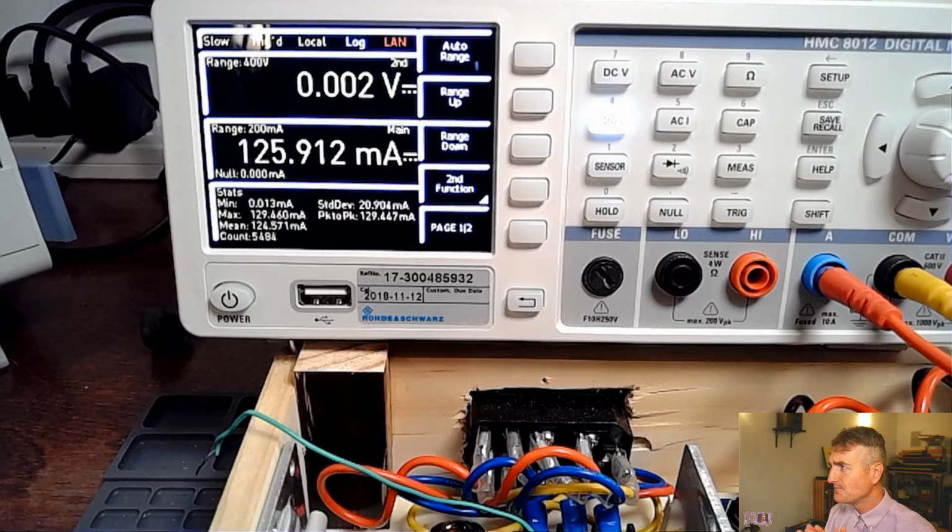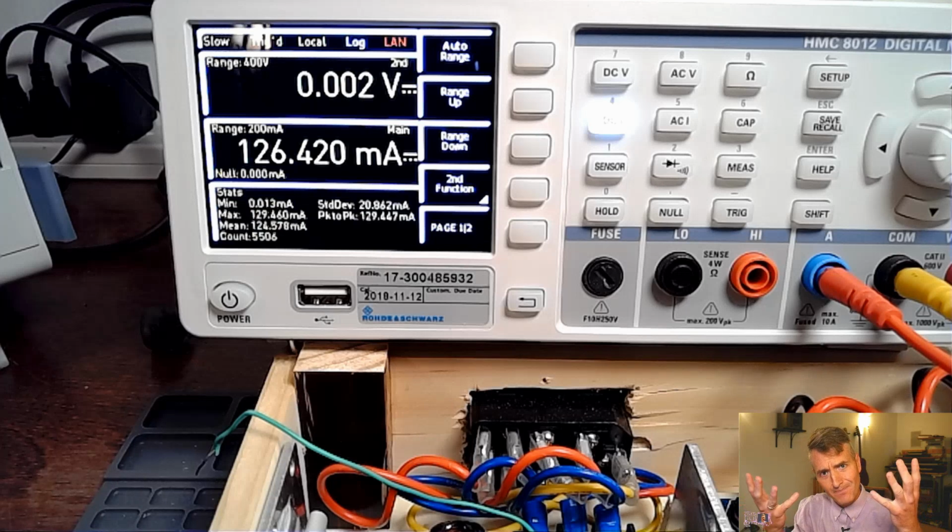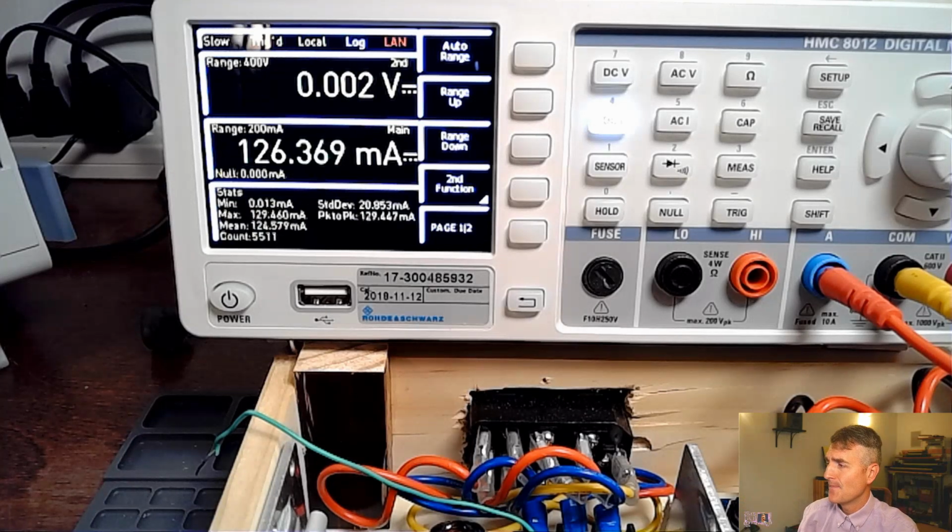isn't that bad. But two things are happening while it is energized. When the amplifier is energized, it is burning more current to do nothing. So why would you waste power? Come on, guys. We're trying to be better. Let's not waste power. But also, when it is energized, random noise can come out of those speakers. So angry cicadas, any sort of electrical interference that's going to pass through the speaker wires or really through the audio input of that amplifier board would be amplified and then sent out. And you would have random noise that would get from the speakers into your ear holes. That is no bueno. No bueno.